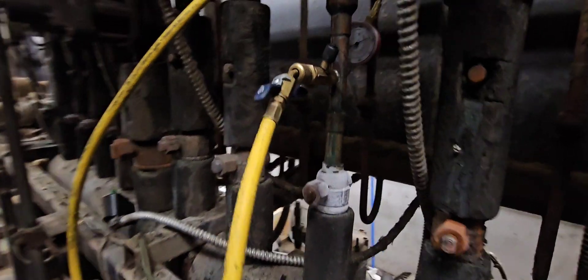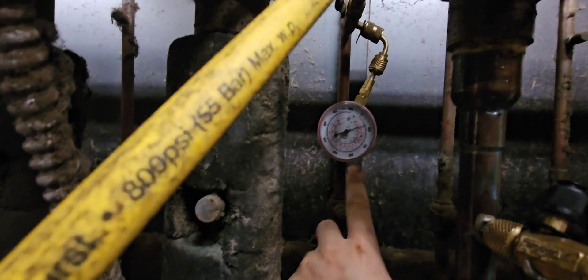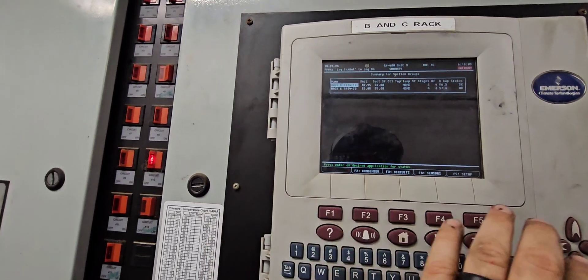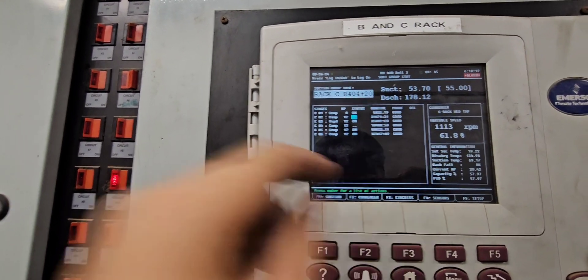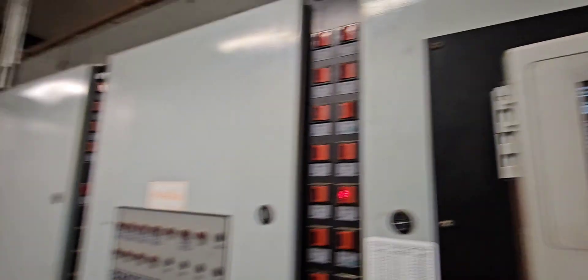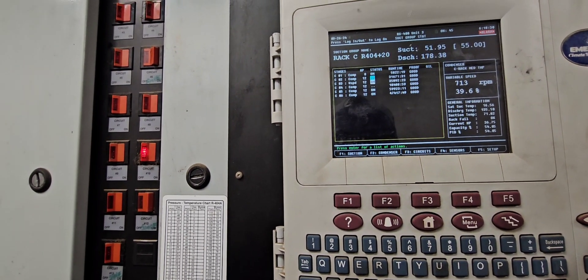We're pretty much done with liquid and just pulling out vapor now. We're at about 60 pounds on this gauge. I'm going to check our suction to see what we're pulling — I want to get that line set as low PSI as I can before we open it up. We're running at about suction pressure right now at 53. I'm going to put all the compressors on manual override to pull that suction down as much as I can. Worst case, we toggle off a couple of systems and pull that suction header down.